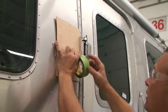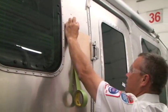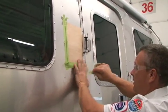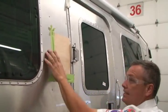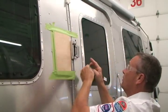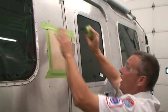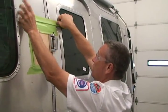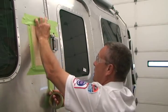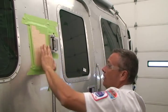I'm going to tape right where I'm going to be working. This tape is our best friend — it stops damage if something would happen and we slip off. The tape is going to prevent any damage to this window sheet, and replacement of that window sheet can be very costly. I'm going to double up some tape up here on top because I don't want to scratch this door frame. This is a customer's unit and we don't want any unhappy customers, so I'm taping it up all around the hinge.